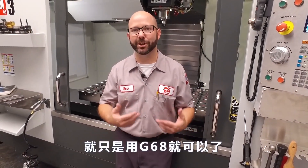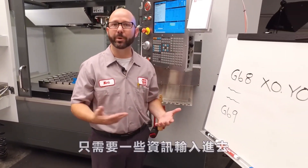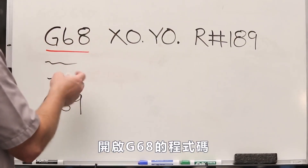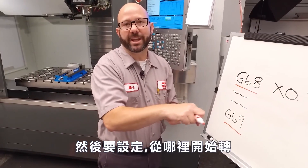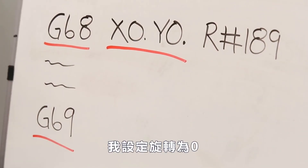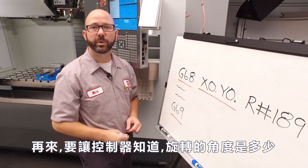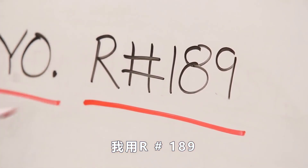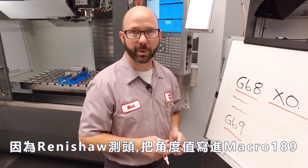So there was no magic, just our G68 cycle. Let's show you how this works. G68 is really easy to use — we really just need a couple pieces of information. We're gonna turn on our rotation with that G68 code, and later we'll turn it off with a G69. Then we need to know where to rotate, which we call out with our XY location. I'm rotating about our zero, so I just put in X0, Y0. Next, we need to know what angle we'd like to rotate our program by. We're using R pound 189.